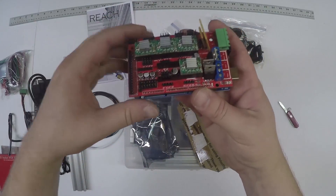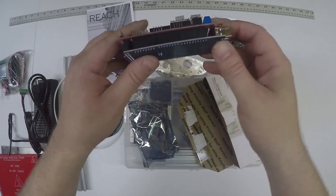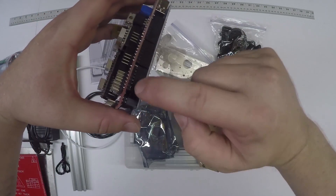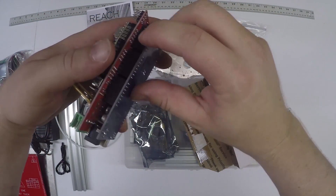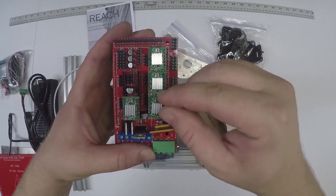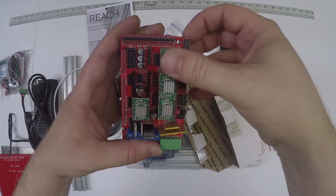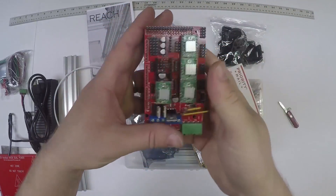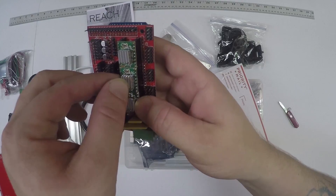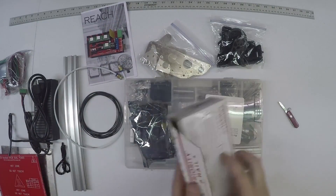Here is your RAMPS board - the red one. You'll have these four chips, which are stepper drivers. The blue board underneath is your Arduino, and they should all be sandwiched nicely. All the pins should be in the slots where they ought to be. You also want to make sure that these cooling fins are properly aligned and they're not shorting out the solder points. Just double check that they don't cross over during shipping.